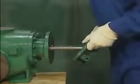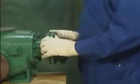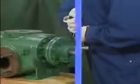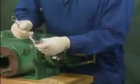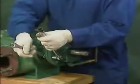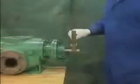The mechanic carefully slides the end bell and its gasket over the two shafts. Then he installs the nuts and bolts that hold the end bell in place. He tightens them until they're finger tight. Then, as he did before, the mechanic uses a torque wrench and a cross torque pattern to tighten the nuts and bolts to make sure that the gasket is evenly tightened and that a tight seal is formed between the end bell and the inboard bearing bracket.